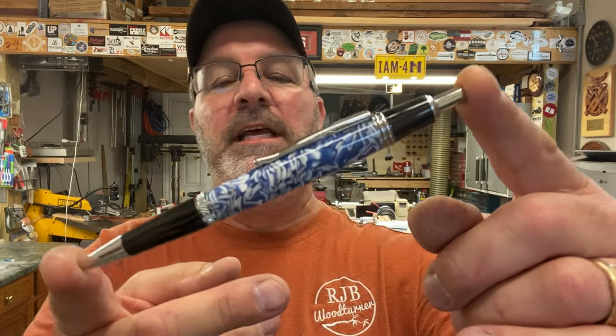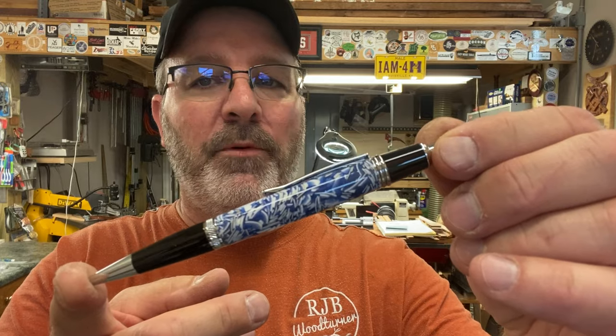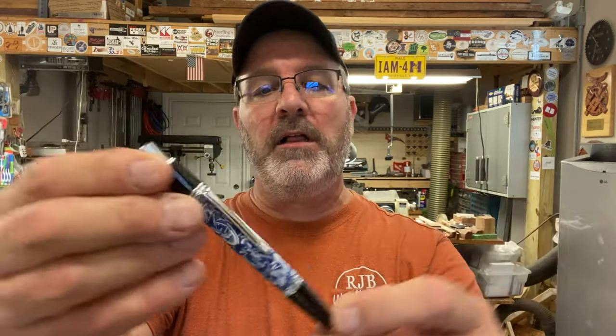I really hope you enjoyed seeing me turn this hybrid eggshell and resin blank — it was a very fun blank to turn. The eggshell is somewhat abrasive; I stropped my skew probably four or five times during the turning and could feel it starting to drag. When you're cutting a blank and you start feeling a little drag where it feels like you're pushing, that's when you know you need to stop and sharpen or strop your tool. Beyond that it turned and polished up nicely — I think the CA finish worked out really well, it's a good looking pen. If you're interested in getting your own hybrid eggshell and resin blank, I spoke to Keith a few days ago and he is going to be making more and offering them for sale, so I will put the contact information in the video description. Thank you for joining me in the shop — you are always welcome here, come back and see me again real soon, and have a great evening.